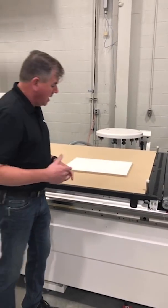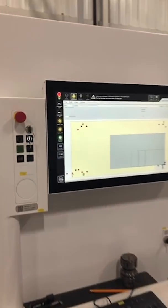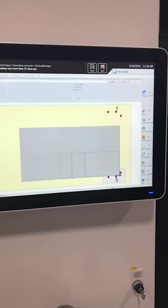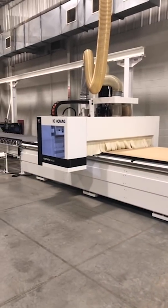Typically on a nested-based setup we're doing full sheets, so the difference is I may not need a saw — I may be using a full sheet of material on the table. You can see I have a pattern up here of three parts; it'll be machined out that way. I put a full sheet up, and when it's done I take off the parts and they can go to edge banding or any other operation in the shop. So that's the basic idea between nested-based and pod and rail. If you have any questions please post on our Instagram and we'll answer them tomorrow at 11 o'clock when we do this again. We pick a new topic every day until we run out of topics — thanks for watching and have a good day.